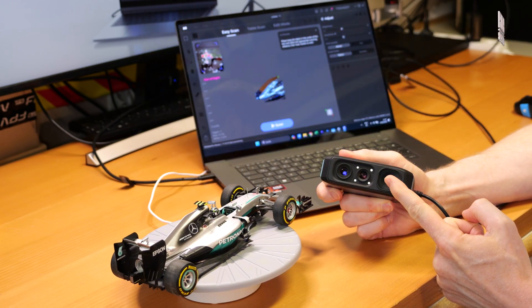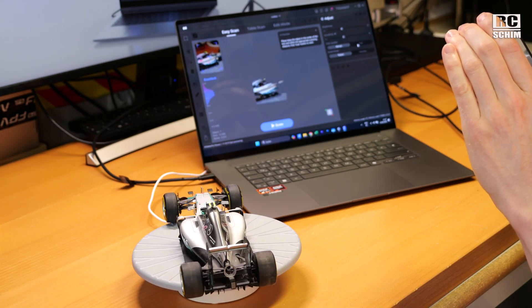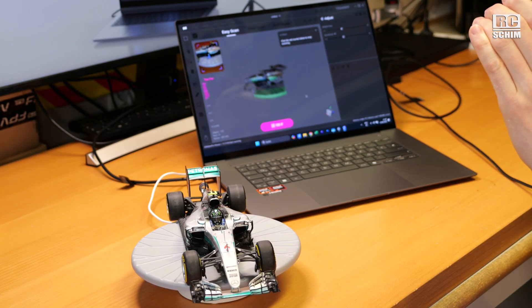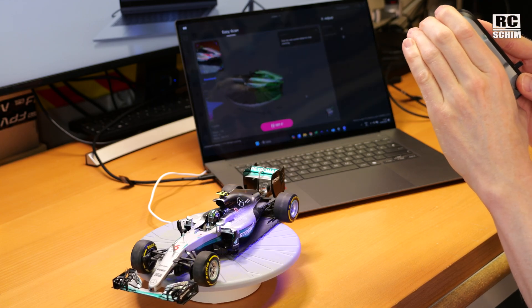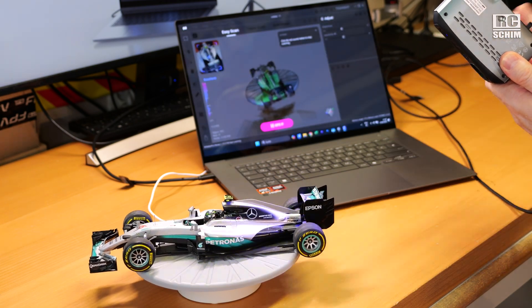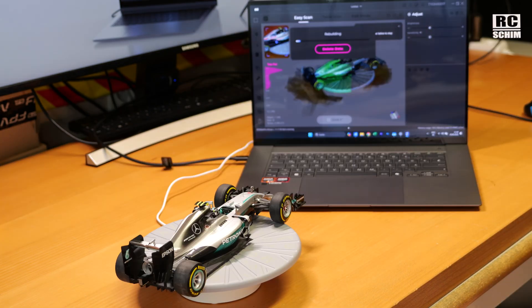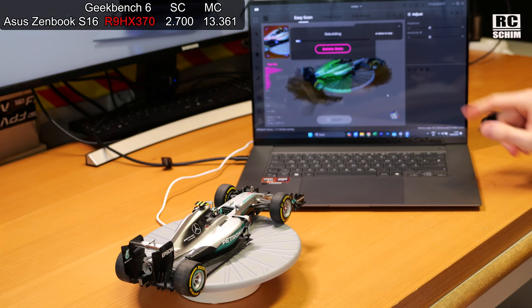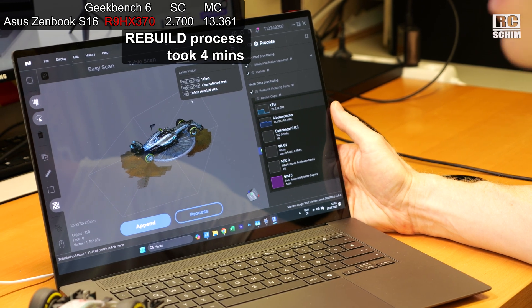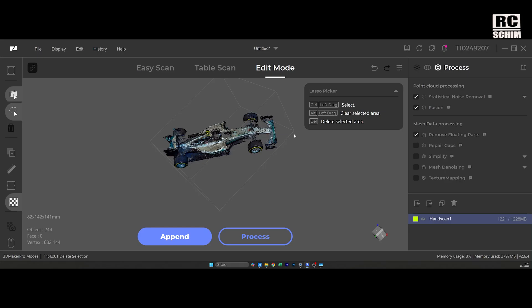As you can tell, this has a strobe blinky LED, and it's always important to get the right distance. Scan quality is set to normal and I'm in texture scan mode because I have a lot of texture on this object — it works best if you move back and forth to get different depth information. You shouldn't make the scan too long; around a thousand frames is maybe almost too long. I want to get all the details, so 1200 frames should be enough. Now the rebuilding — I have a new laptop here, quite powerful, and it uses all of the cores. 90% CPU application is good. Let's continue with the screen grab. Cut the bottom away — this looks pretty good already. Scan the underside.